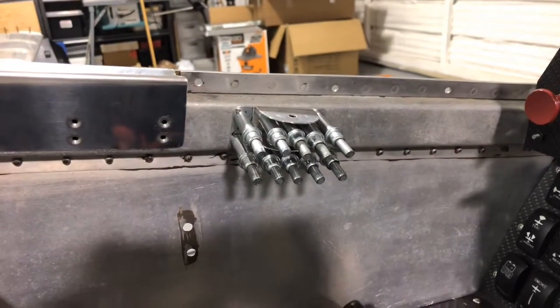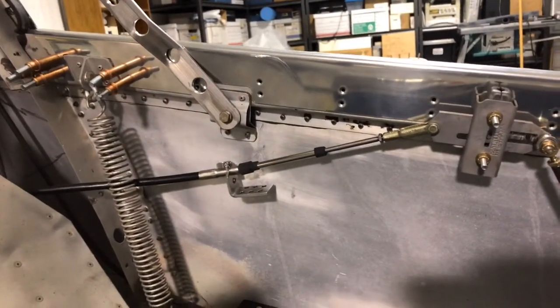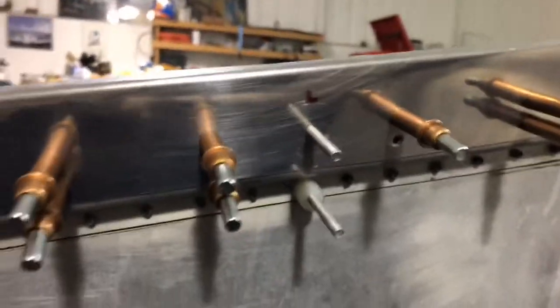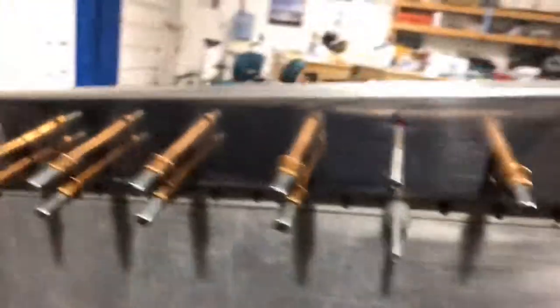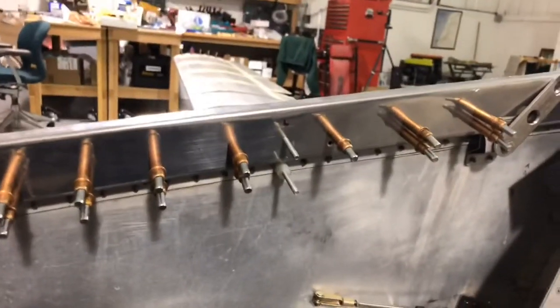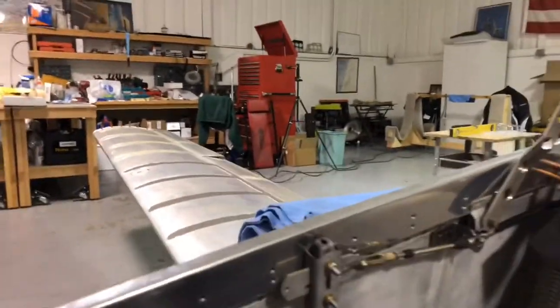I've got the doubler and parts for the handle clicoed and ready to up-drill, but first I'll work on these rear mounts and make sure I get those in the correct position as well. I now have the right side drilled for the Hartwell latch, with the little plastic bushing that holds it out so I get the proper alignment, trimmed to size. The right-side Hartwell is now installed.